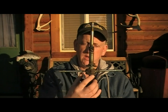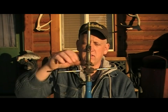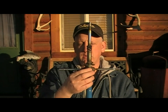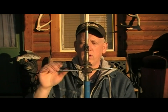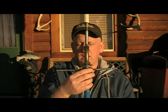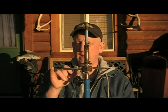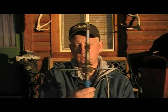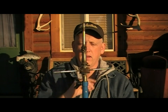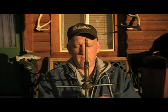What I did is I welded a flat washer onto the shaft fairly snug, then I took a big nut — the center of this unit — that fits easily over the shaft and spins freely. I set that over and then welded another washer above it all the way around, making it relatively flat. On the nut in the middle that can pivot, I took two more bolts, put them head-to-head against the big nut on both sides, and welded those down so that I have about a nine inch safety catch at the hole. For a seven inch hole this should never fall down the hole.